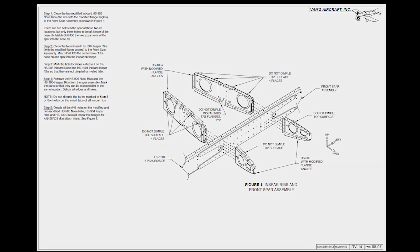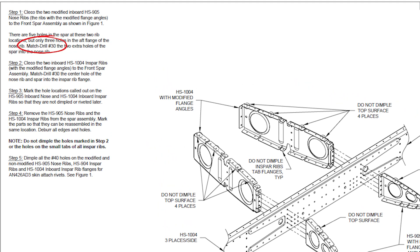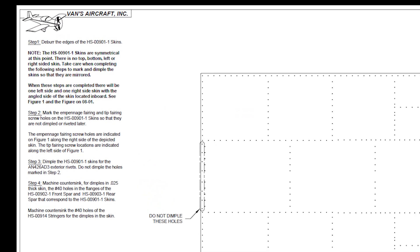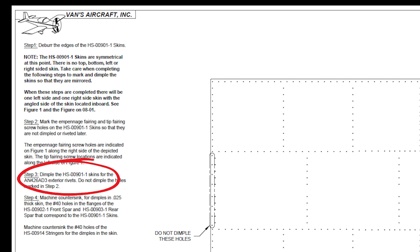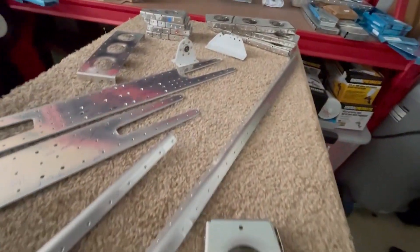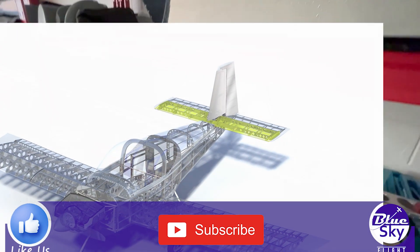So this is where I left off for the week. Reading ahead, there are only a couple of holes that need drilling and countersinking before I start to rivet the ribs and the sub-assembly to the skins. So time permitting, next week I'll tackle those holes, pull everything apart, deburr as needed, and get everything primed. That's a wrap on the first 4 days building the horizontal stabilizer. Please hit that like button to help support the channel if you would — thanks so much for watching. We'll see you on the next video.